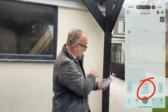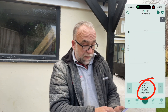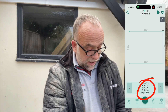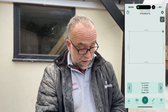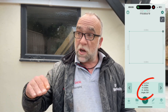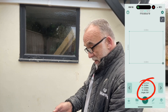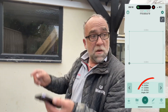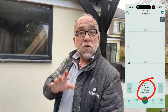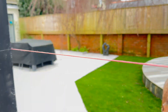This is where we started, so this one's zero, zero, zero. The second one over there has got to come down one centimeter. That one over there in the corner has got to go up three centimeters. And this one by here is down another two centimeters. So I'll remark it now. I'm going to step the levels back on and try it again. As you can see there, that's my first marker.